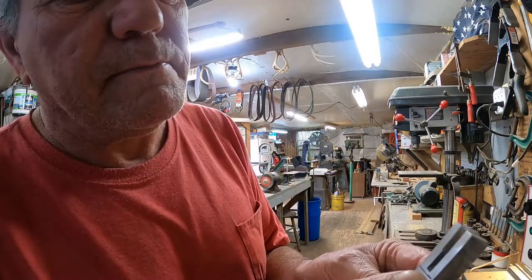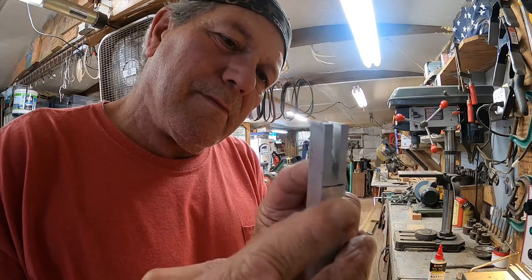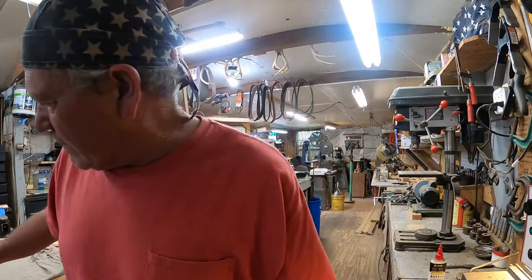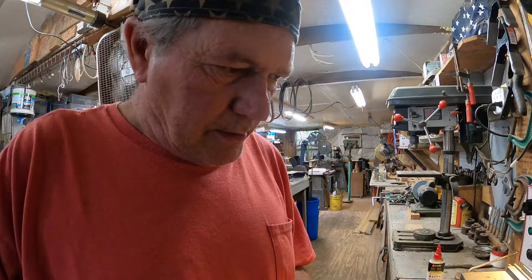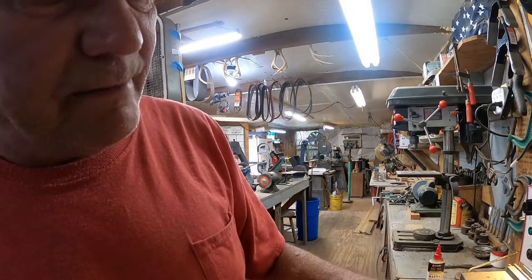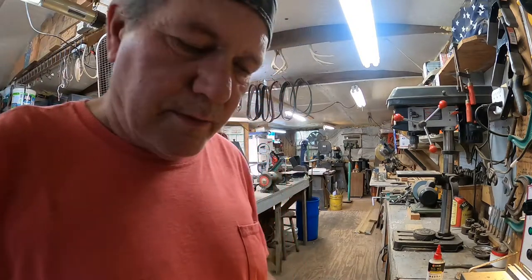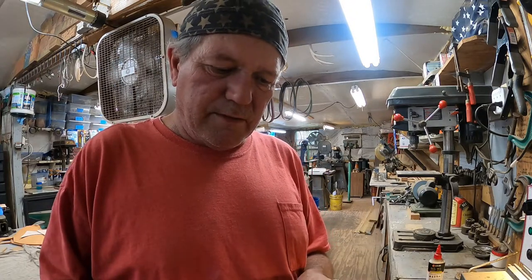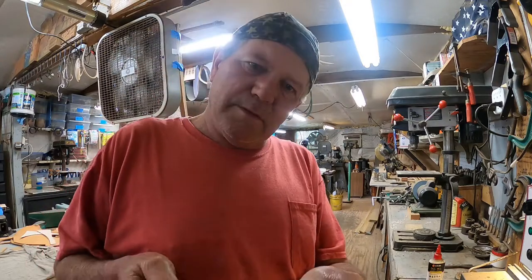All right, like I suspected, right there in the center it didn't cut, but with a bigger, wider blade, I think it'll do okay. I'll have to get on ordering one of those. Now, like I said, I've never used this, so I didn't know exactly what to get. I did have to get a saw collet, which costs more than the blade. But now the fit, that's 1/8 inch thick for 1/8 inch fit. That's going to be perfect.